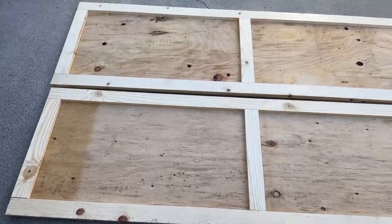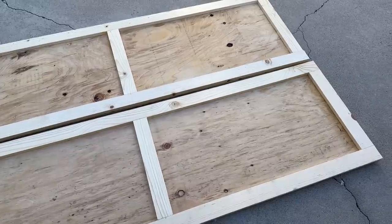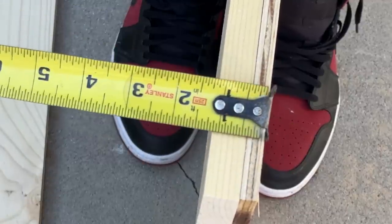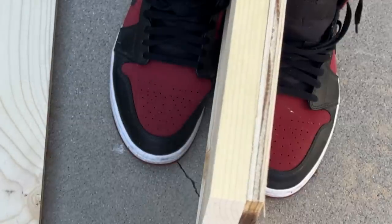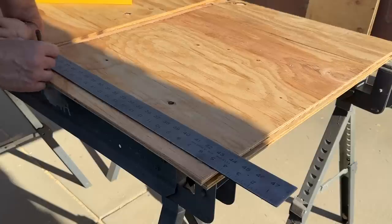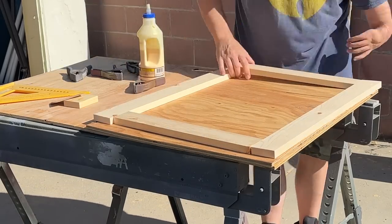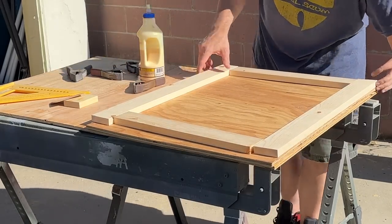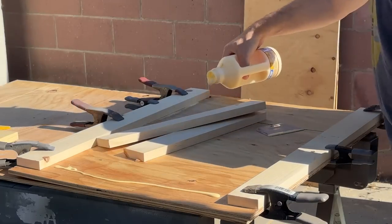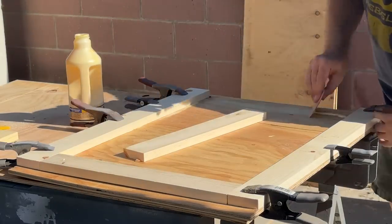Once the sides are assembled, I can shift my attention to the front and back panels. To make transporting the coffin easier, they asked that it be able to be disassembled. So before I build the front and back, I'll need to measure the thickness of the side panels so that I can offset the framing to allow them to be joined with a minimal seam line. After I take my measurement, I can mark off my plywood, scribe a guideline, and then get to gluing everything in place. I like to use a plastic scraper to apply glue since it's easier than using a brush and cleans up a lot faster as well, giving me even coverage and a solid bond between my materials.